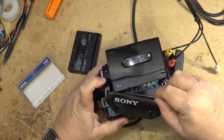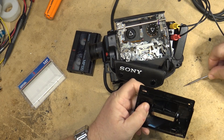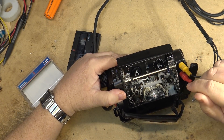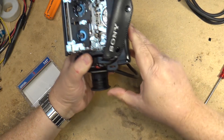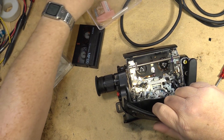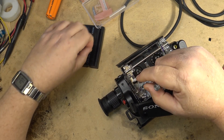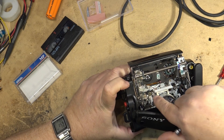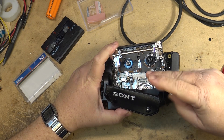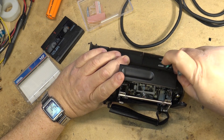This is a late model, and to open up the front compartment there are just a couple of little clips under here that I'm flipping out of the way — and I just broke one. I have a problem with plastic as it gets brittle. Here's the mechanism on that — this is a B mechanism camcorder. I'm going to pop the side off to work on it, remove the arrow-marked screws. This one is actually going to be a very easy fix; I'm hopeful it's just one or two of the guides that have shifted.